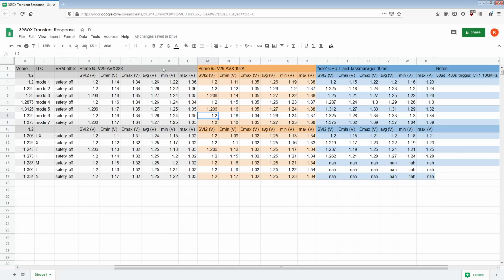Like, actually no, it doesn't even pick up. It picks up 10 millivolts of undershoot, so it gets 10 millivolts less undershoot according to the not that accurate oscilloscope. It could actually be like 6 millivolts because of the rounding, but yeah, you don't see a huge increase in the required voltage at idle, and you get a nice little improvement in terms of less undershoot, and that's it.